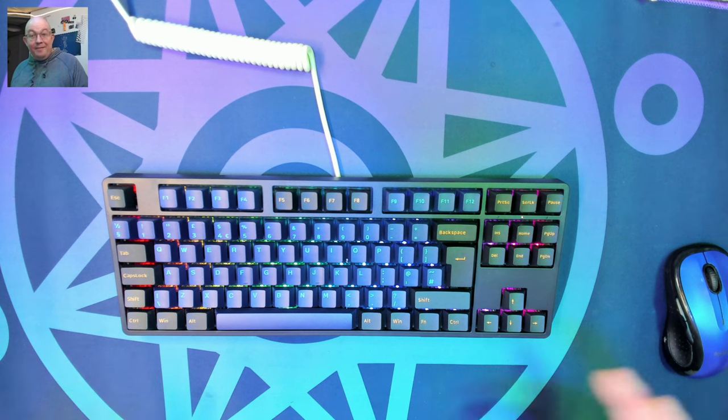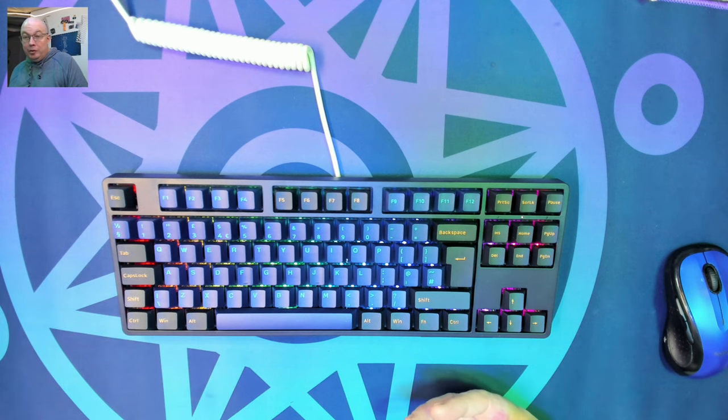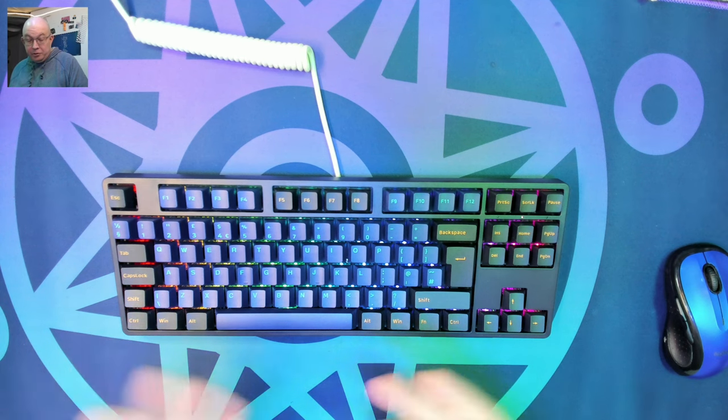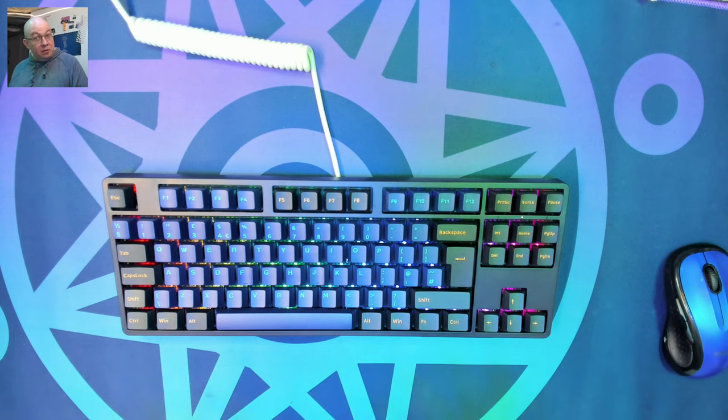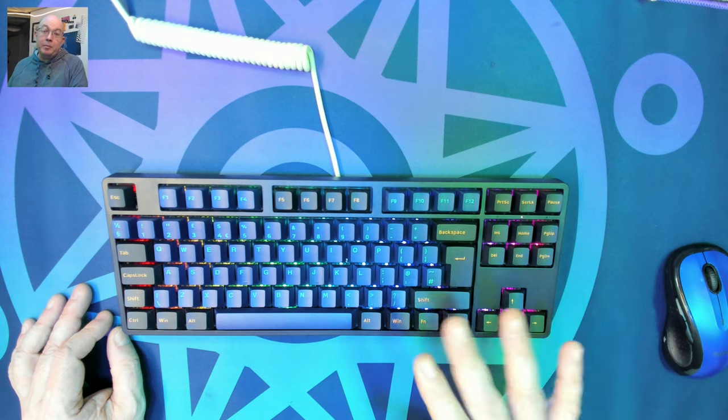And then if you want to add functions for specific key color sets, you basically add a method and you set the key colors with the key codes in there. And then when you're in VIA, you would pass that code down to call that method, and it will change your key colors if the MCU supports it, which most QMK MCUs will. But anyway, at $50, I think this would be a great buy.